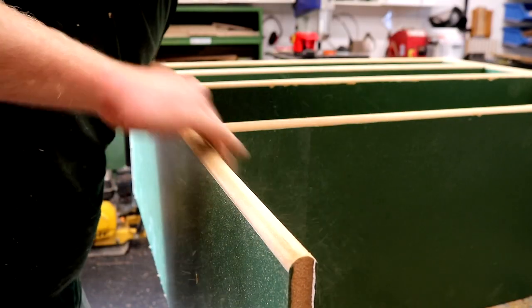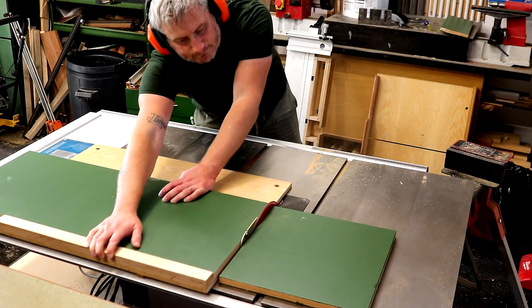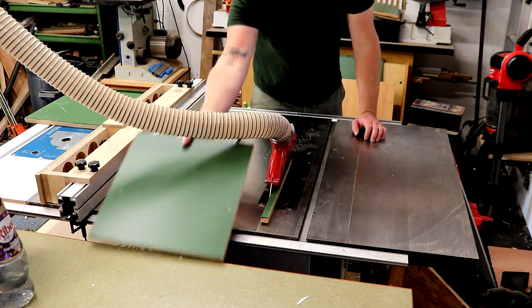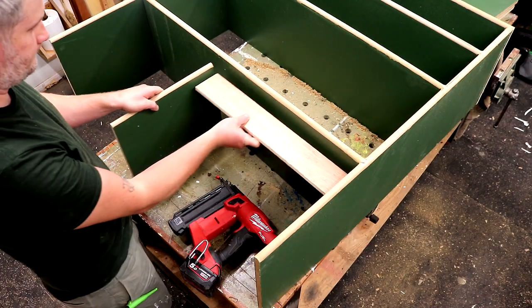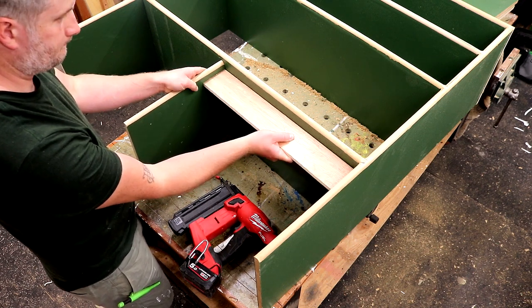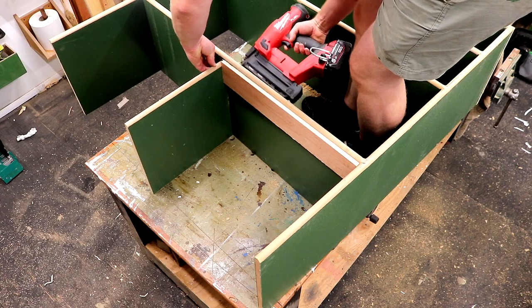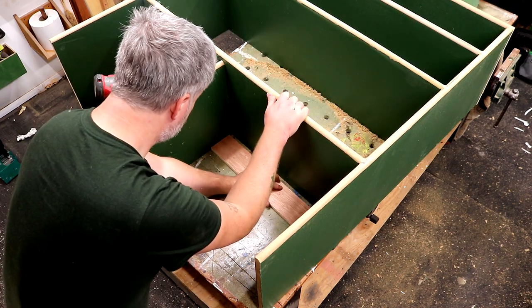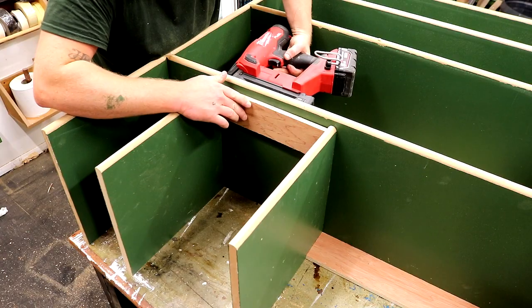I then gave them a light hand sanding at 100 grit. Next I'm cutting some section dividers and after cutting them to the heights needed I also trimmed off 20mm from the width of these pieces just so that they leave a bit of a reveal from the horizontal shelves. You can see the horizontal shelves are overhanging them slightly which I think looks nice. I'd already added a round over to the front edges of the dividers off camera and I'm using spacers — scraps of plywood — to get the dividers exactly where I want them. I'm nailing the shelves in place, no glue here just in case I ever want to remove these in future.